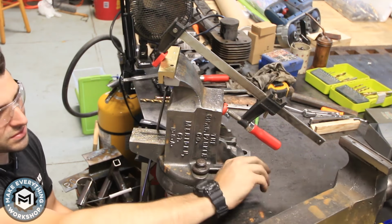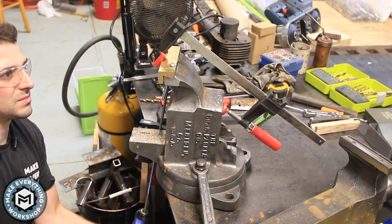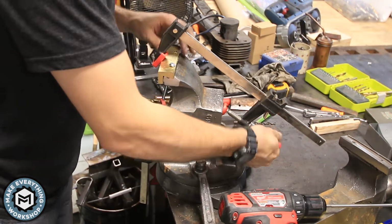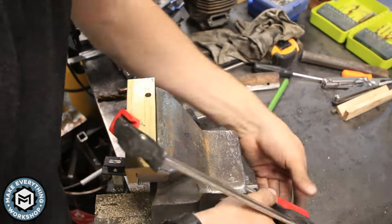The drill bit size on this was a little over 1/4 inch, which was nice because I used a 1/4 inch locating bit to drill up through the bottom and gave me a nice rough estimate of where these holes had to be, and they were at the proper angle to fit through the vise jaws. It would have been almost impossible to do this from above with a blind hole.